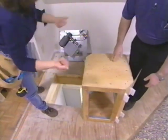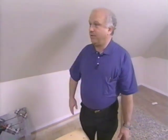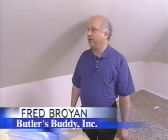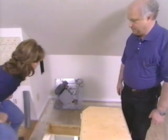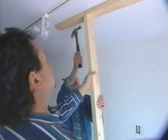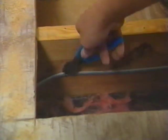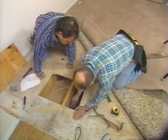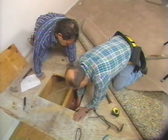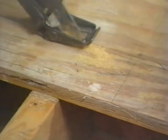Is this something the homeowner can do themselves? The advanced do-it-yourself homeowner could do a dumbwaiter installation, although many contractors do installations for the customer. Let's go over what we've already done by cutting the hole in the floor. In this application we had to remove a floor joist, so we brought in a qualified contractor to do the necessary bracing underneath. Another good reason to hire a contractor is if there's any plumbing or electrical wires in the floor — they can address that on the spot. Not every application will require cutting through a floor joist.